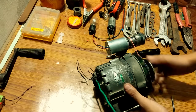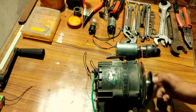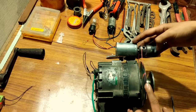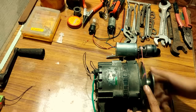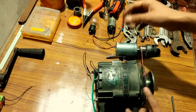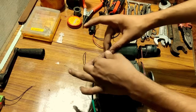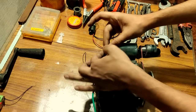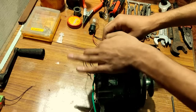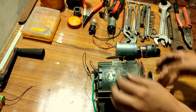So what is happening is when we rotate the shaft of the alternator, then with this pulley, this pulley rotates the shaft of the small generator, and this small rotation is enough to generate a small electric current. I am going to demonstrate it with an LED bulb. It is a really small generator and you can use an even smaller one if you have — that will work too, since it is just to activate the field.